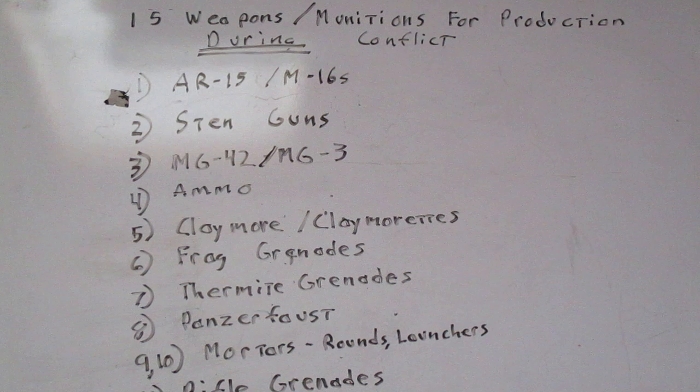The milling traps the selector in semi-automatic mode. Most people don't realize a Sten gun can fire in both semi-automatic and fully automatic. Just like with the AR-15s, I recommend putting together an example or two of the Sten gun in semi-automatic so that you learn what to do for welding the receiver tube to the lower receiver, and learn how to mill out the different holes and ports required on the receiver tube. Also get a hold of a bunch of magazines — there are a lot of Sten gun magazines on the market.